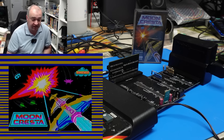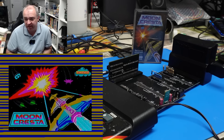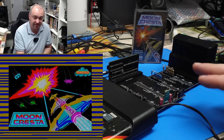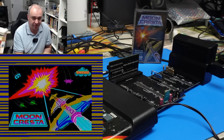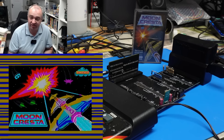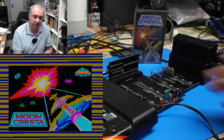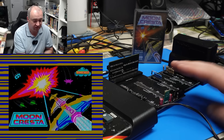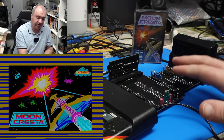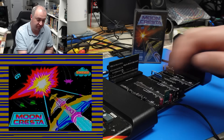I've been playing with this off and on for most of the day and it seems to be fine. We're currently loading Moon Cresta, and for the most part loading software now works perfectly. Although you still do get the odd crash sometimes - I'm not sure if that is actually related to our backplane or if that's just a Spectrum being a Spectrum. We are loading from ZX Play on the tablet. I'll probably have to get myself one of the SD card loaders - that would be a lot more reliable, and another device to plug into our backplane. I think for today I'm happy enough to call this successful, even though it has been quite the journey getting here. The board probably could use a little revision just to add in proper termination rather than doing this sort of jankiness, and maybe even adding in buffers properly. Also need to figure out the power side - that bit has me a little perplexed. If anyone has any ideas on that, please let me know.